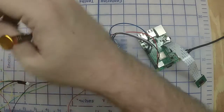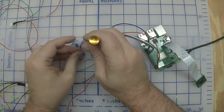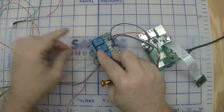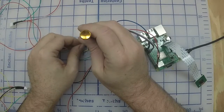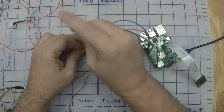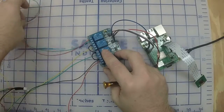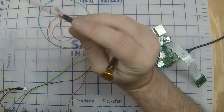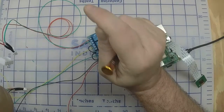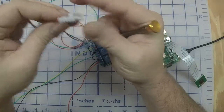The second cable, there's 2 wires only. And they go under, doesn't matter which one goes where, the last 2 screws. Give it a little tug. And get, whoop, didn't go in. Give it a little tug, we're good. Now, this one with the 2 wires, if you unplug the power button, it plugs into the circuit board on the Peopoly Moai. You unplug the power button and you plug this in. Then you plug the power button back into the other side. It can only go one way.